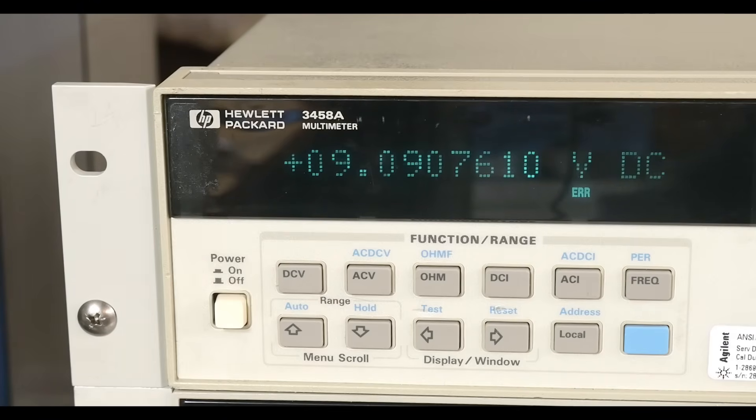I know there's a lot that goes into metrology — you have to have regulated temperature, regulated humidity, regulated EMI, and regulated test connections, because the connections themselves can cause voltages. So this will be a brand new world for me. But let me show you what the instrument does.